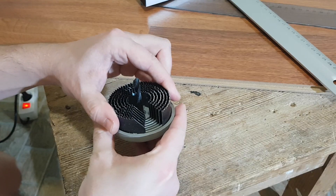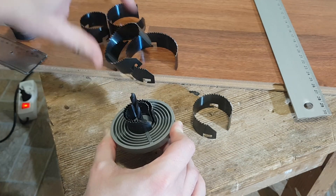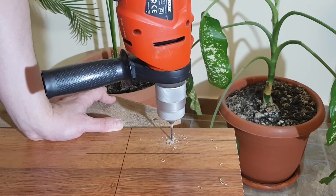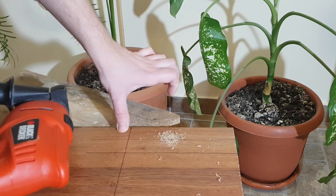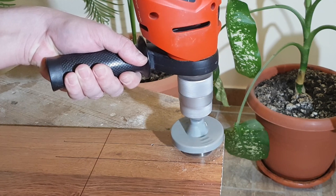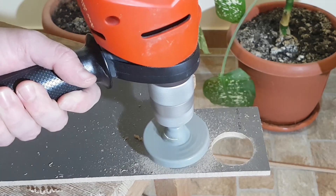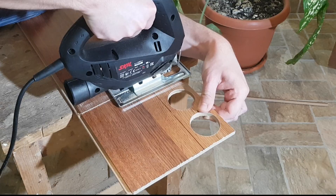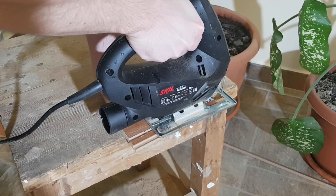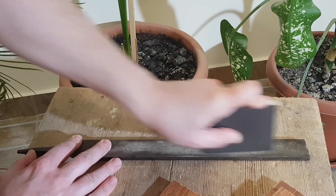Remove all the blades, then mount only the correct one. First, we drill a smaller hole to mark the spot for the speaker hole. It's better if you drill the holes from both sides — it will prevent damaging the hole's edge. Now let's mark and cut all the pieces. After cutting the pieces, use a wood file to make the edges smoother.